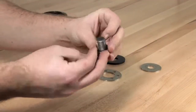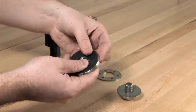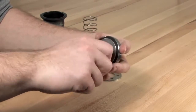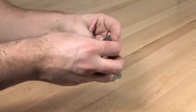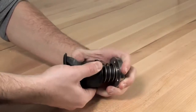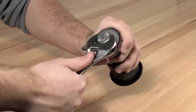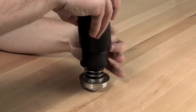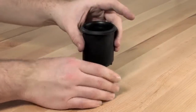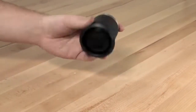To reassemble the relief valve, start by rebuilding the piston diaphragm assembly. With the unit rebuilt, replace the sleeve with the ribbed edge facing upwards. While still grasping the sleeve, fold the top of the diaphragm over the ribbed edge to hold it into place. To properly refold the diaphragm, cup your hand slightly and force the sleeve down over the piston assembly with a rapid slap as demonstrated.